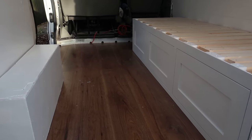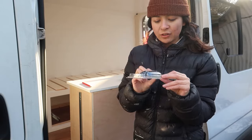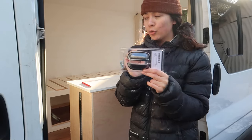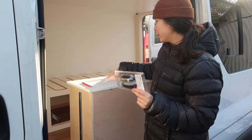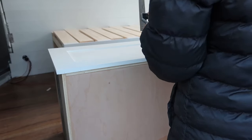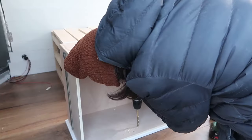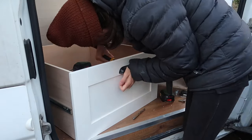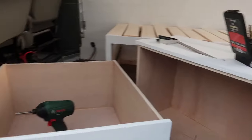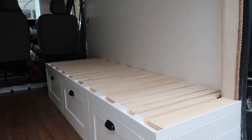We've got these cup handles from IKEA - they're about nine centimetres long and from screw to screw they're 64mm. I'm going to measure that out on the top part of the drawer front here so they'll be sat in the right position. There's a handle fitted.